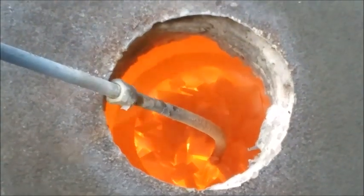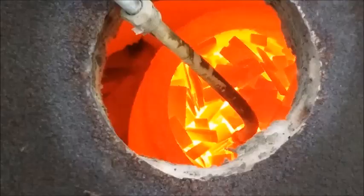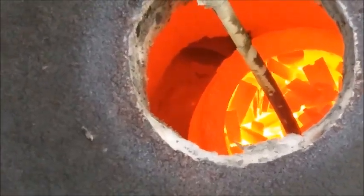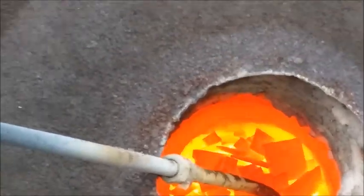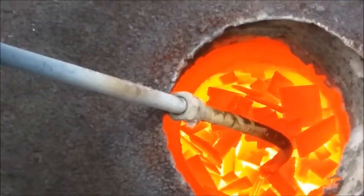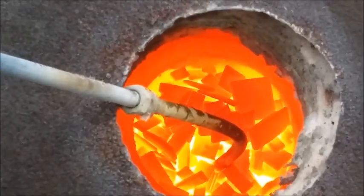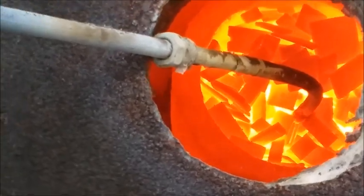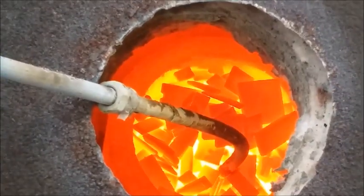The plastic is combusting, the carbon is combusting away — it's a beautiful thing. I turned the propane off entirely, and it's been off for quite a while, but look at how brightly that crucible is still glowing as the carbon gets burned off in the airflow. It doesn't need any external heat anymore — it's generating its own heat. In fact it's getting hotter than the propane fire could have gotten it. That crucible is glowing bright orange and it's white hot in the middle.